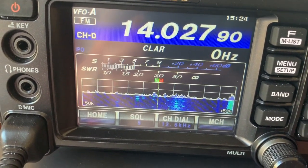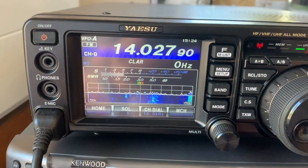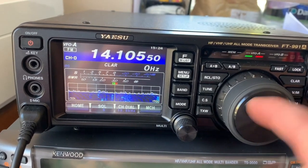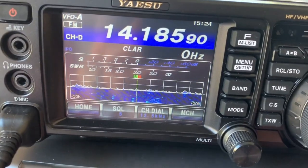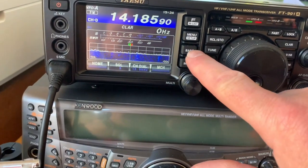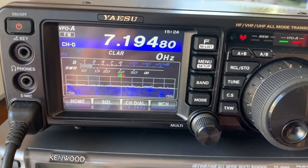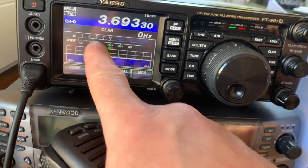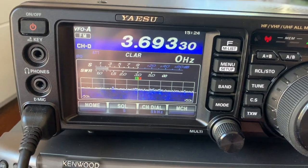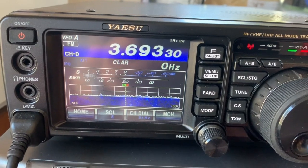The capacitor has brought it down below two — about 1.9, 1.8, 1.9. So it brings it into the usable side of SWR, which is good. Going further up the band, still below two — still usable. On the other bands, still well below 1.5. I need to solder that joint because it's going up and down, but the worst it's going to be is 1.5 and I think the reality is it's below that.